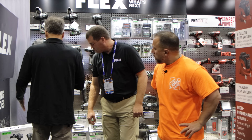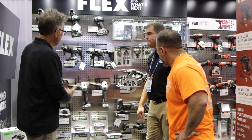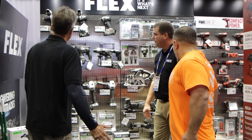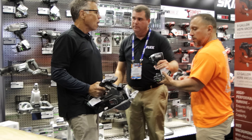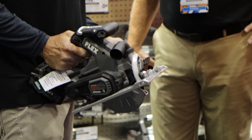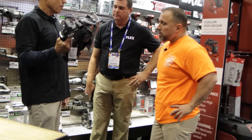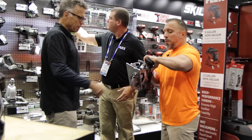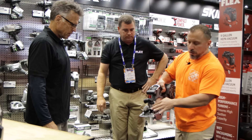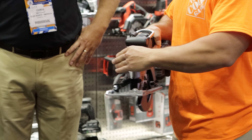If we transition out of the world of drywall tools — a six-and-a-half inch inline circ saw. I was just talking to a guy who said why do they even make a seven-and-a-quarter anymore? He said this is his go-to tool because it will rip through three-bys. It's light, you have good sight lines on both sides. And the dust collection, dust swivel, and dust management — give that a feel.